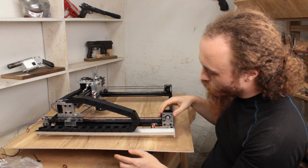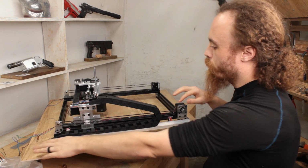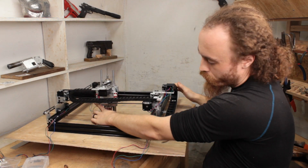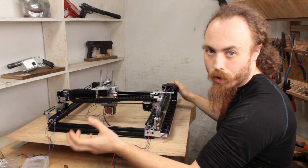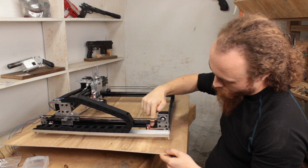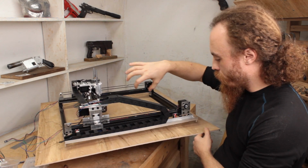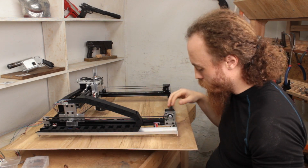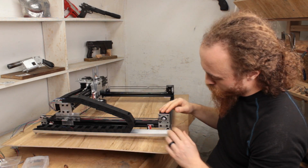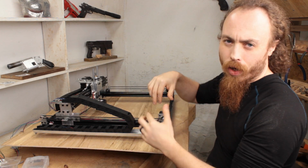So when you're actually mounting it, some of them mount really nicely, like this one, where the 2 holes just go right into the V-slot, problem solved. And then the same on this one right here, the 2 holes are drilled right and tapped right under there, 2 M3 screws, boom, done. But on the other side, you've got to custom fabricate little mounts so that it holds it in the right location and orientation, because you're a little bit limited on stopping it from rocking based on where the actual V-slot is.